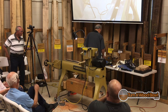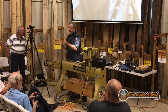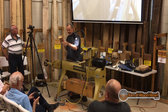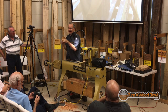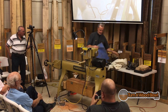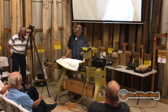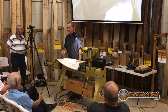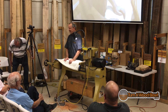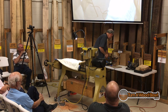I'm going to show you this on a new piece. This blank has been sealed with shellac so the ink won't soak through — shellac and shellac go together. I'm really trying not to make a mess. These first two techniques can be messy, but this one — the ink — is the messiest. By the way, did you notice I put gloves on with the iron acetate? Apparently we have tannin in us too. When I first tried it without gloves, I turned my hands over and my finger was completely black. To clean up, you can use rubbing alcohol.